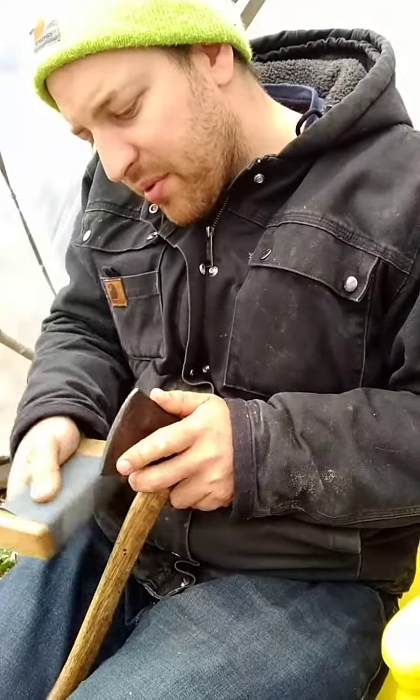And then I'm looking to keep the edge totally on the sandpaper, which again is what I like about having this movable block with the sandpaper around it, is that for me it's much more intuitive to move that against the knife, or to move both it and the knife and just pay attention to their connection, than it is to lock something in place and then have to move the axe perfectly.